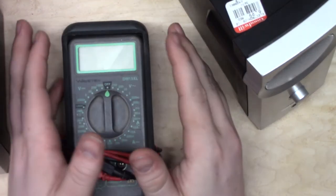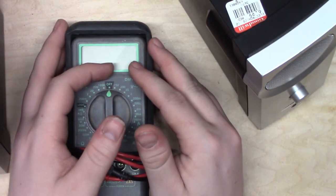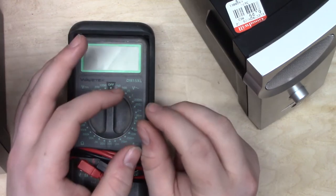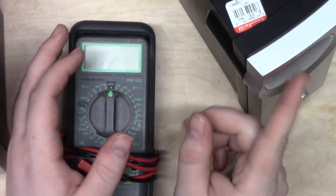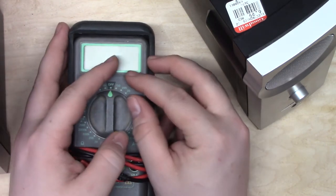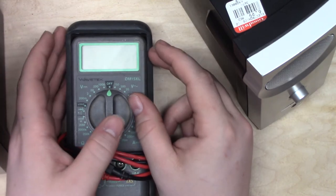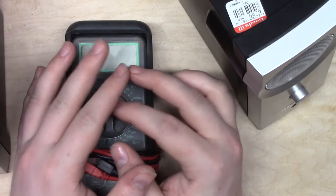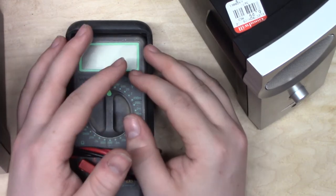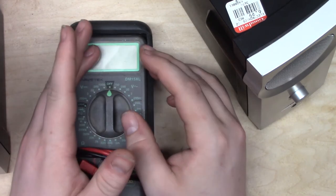The reason that AC and DC voltages get used has a lot to do with how the technology inside the device works. These speakers have a driver which uses positive and negative voltage in order to push these speaker cones in and out. Now, I'm going to admit that I'm not much of an expert on the way that audio amplifiers work internally. I used to work on them, however, and I do know that they absolutely require negative voltage to work. You could create a sort of false ground in order to produce positive and negative voltages from DC, but it's kind of a pain in the ass.